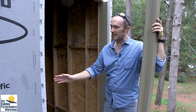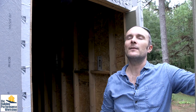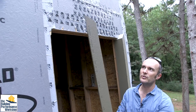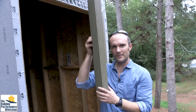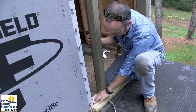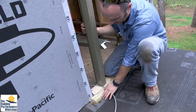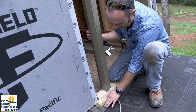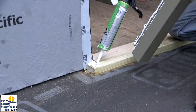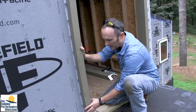We're now in line all the way around. We removed the extra jack stud on the door, moved the header up, and attached it to the king with the lag screws — that took about an hour and a half but it needed to be done. Now we're putting the thermal buck on the door opening — we've got the beveled picture-frame top edge just like always, but on the bottom we have this, which I did with my knife. We had to bring it up with wood instead of thermal buck, using pressure-treated wood buck because it's going to be sitting on the floor. We're going to flash over this with stretch flash tape, sealing the thermal buck to the wood buck.